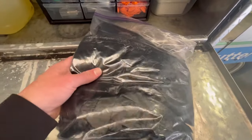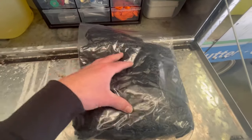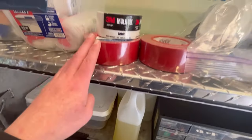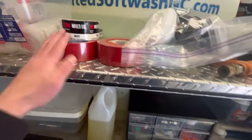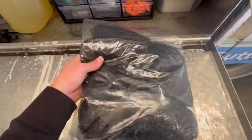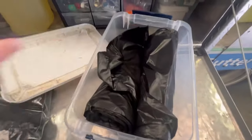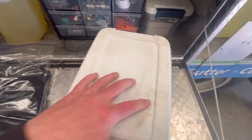Moving to the right, I keep one of these two-gallon freezer bags and I have black grocery bags in here. I use black because this is what I use to cover people's cameras and electrical outlets. Use the Sure Tape — don't use duct tape, and don't use blue painter's tape because that just soaks up water. You could still burn up outlets with blue painter's tape. Then I keep these big heavy-duty contractor trash bags here, for whenever I'm doing gutter cleanings — I go through a ton of these.